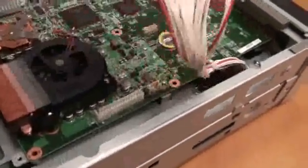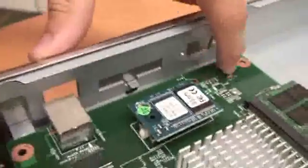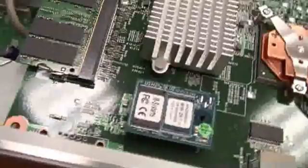After removing the power supply connections and getting all the screws out, it really looks like there'd be room enough for a serial port here and a USB there. But there are actually no pads — nothing else to hook up a USB. Just this thing for the serial port. That's still kind of interesting. I'd love to hook up a little RS-232 and see what that does. Looks like the chip's missing off of it though — a little controller chip for it.